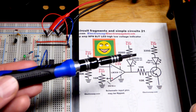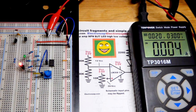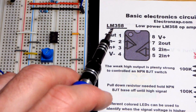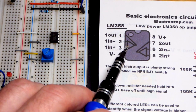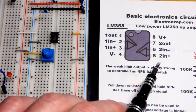There are some things we have to take into account, so I'll take this apart and build it step by step. First thing we're going to do is look at the pin layout for the LM358. Different op-amps have different pin layouts. This one is a dual op-amp — one op-amp on the left side, one on the right.